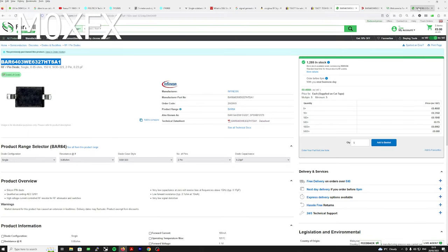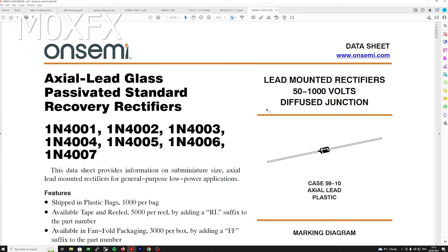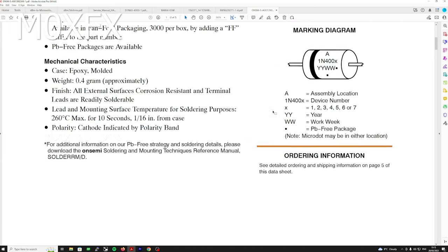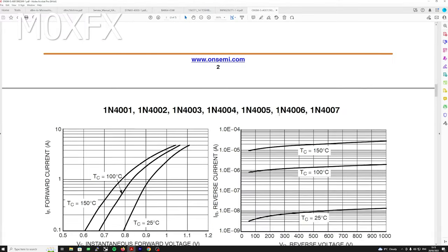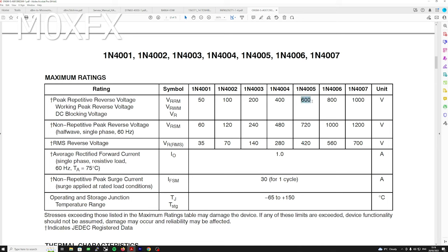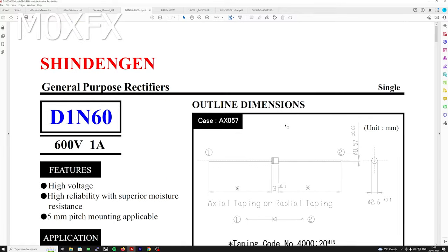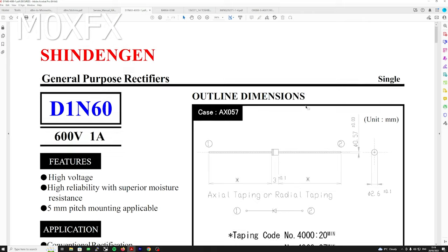Looking at what I actually installed — I got these from Farnell, made by On Semiconductor. These are very common. If you buy five they're quite expensive here, but I'm sure you can get them a lot cheaper. The data sheet shows the 1N4005 is rated at 600 volts and 1 amp. Comparing that to the original — it's also 600 volts and 1 amp. So there we have it — that's the diodes. Thanks for watching, and we'll catch you in the next video.